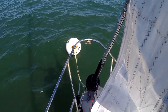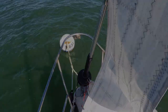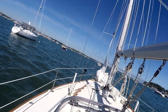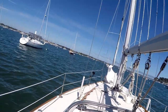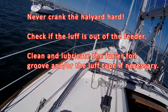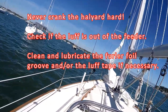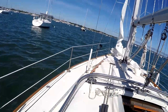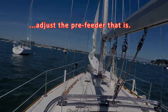That's the way they were set when I took the sail down, so let's start with the hoist. I'm going to start taking the sail up — we'll see if it feeds smoothly. Seems to be going pretty well, but it's a little heavy. I can give it some help with the winch, but you don't want to crank it real hard. If it's very hard, that's probably a sign it's not feeding properly.